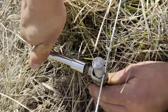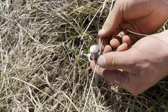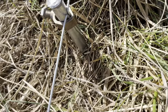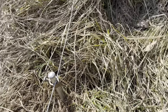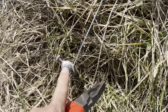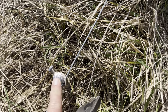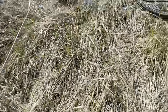Folks, if you don't have a good grounding system for your electric charger your whole electric fence is going to have troubles. That sucker's in there Joel — that's not going anywhere. All right, let's go to the next one. We took one of these and put it on the far end of the farm, so we got one ground rod almost a mile from here, and the other five are going to be right here by the charger.